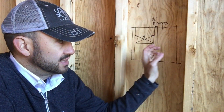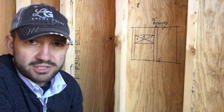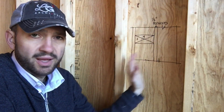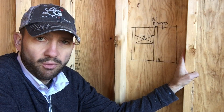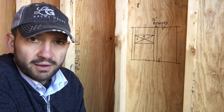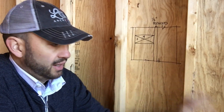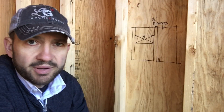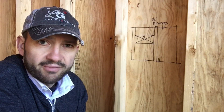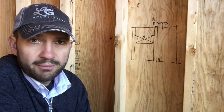As opposed to when insulation is in the cavities — it's every stud, whether it's 16 or 24 inches on center or 12. Each one of these studs is a thermal bridge; you get about R1 out of each stud while the cavity insulation might be R15 or more. If you take R15 and average out the R1 of the studs, plus all of your electrical boxes and other penetrations, you end up with a much lower effective R-value — somewhere in the R11 or R12 range, maybe even lower depending on how much framing you have in the wall.